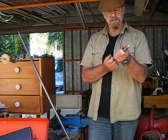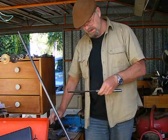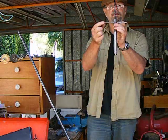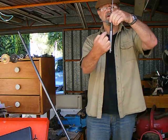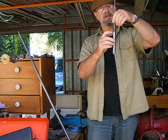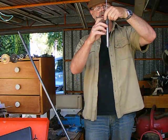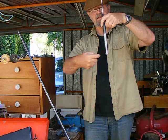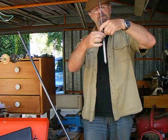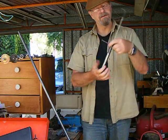In operation, the way I've designed it — the top of the tool — you just use that top hole and put a locking pin in here. This also stops torsional twisting in the body and holds the body of the tool together so it doesn't tear in half with the forces involved, because it's a little bit thin there. That's the obvious point of stress in the tool. It actually pulls through the body in an L-shape — the force transfer gets transferred up to the top, so the tool body is actually being compressed. So obviously that's mammothly stronger than you need.